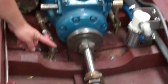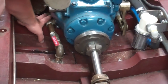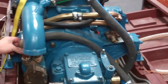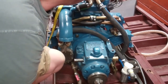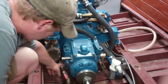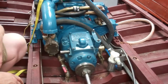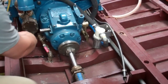The water intake is right here. It comes in — it had a Y and then a 90 off of the Y when it came in. One hose ran up and into the top of the water pump. Then it circulates through the motor and dumps out here, which brought the warm water out and mixed it with the cold water that was coming in here. So you're not running ice cold water or hot water either.